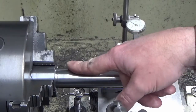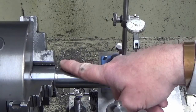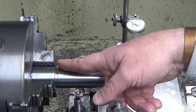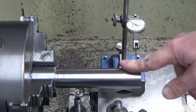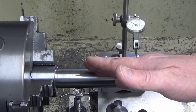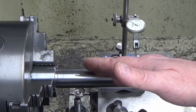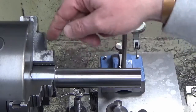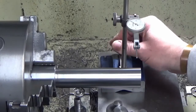If you're putting copper in and bits of aluminium and goodness knows what else, they comply with the chuck jaws and they get chewed up, and you'll never get anything that runs anywhere near concentric in a 3-jaw chuck. Fine for a 4-jaw chuck, but 3-jaw not very useful if you want to try and keep things concentric. So as I say, I use the shim stock.